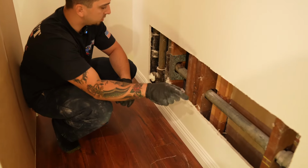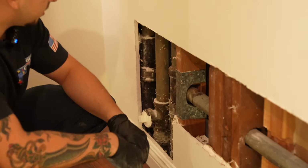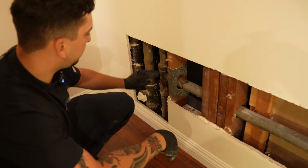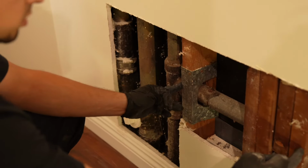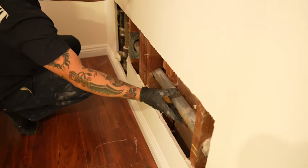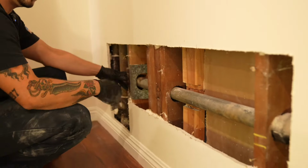Here we have this 1.5 inch drain line that runs all the way across for the sink. It's gonna connect into the vertical pipe in here where it converts down to 2 inch. So now we're gonna have to cut down here at the bottom and put a new T in. We should be able to cut this pipe out, slip one in, connect it into our T, and then we'll have a pipe and coupling built going that way. You gotta take the punches as they go, you know?